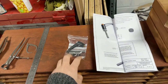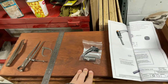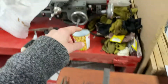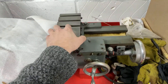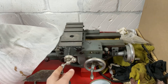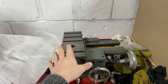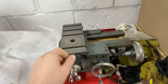This last item is a Hemingway Kits locking handle for the lathe carriage. I'm a little disappointed because this part is plastic and I'm really trying to get away from using plastic, but this looks like a very quick build. You essentially make a small collar out of this bar, thread the end, and it goes down into the hole where the bolt currently is. When you tighten it, it locks the carriage — so the handle replaces the bolt. That means the carriage can't move laterally, which is very handy for things like parting off where you want rigidity, or if you're milling and want to face something without risking backlash. Having a handle there for a quick on/off I think would be very handy.